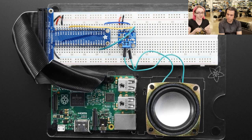It's easier for them to send out the digital signal, and also it's less noisy because you don't have static or high-speed signals, or the power supply creating fluctuations. If you're making an audio system with a Raspberry Pi, you know that the headphone audio is pretty good, but it's not hi-fi quality. There's a little staticky effect. You have to really turn up the volume and turn down your amp, and if data is being transferred over Wi-Fi, sometimes you'll hear it. Whereas with I2S, you don't get that because it's a pure digital signal.